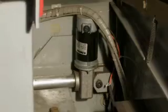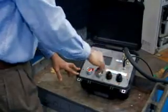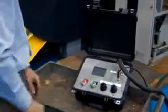It's also important to know that the breaker remains in trip-free condition between the test and connected positions. Therefore, if an inadvertent attempt to close the breaker occurs while racking, the safety interlock will keep the breaker in a trip-free state, as indicated by the green light on the door, for the duration of the racking operation.